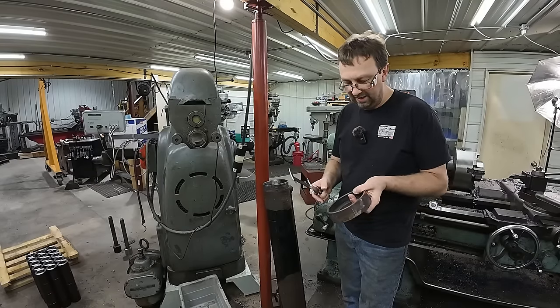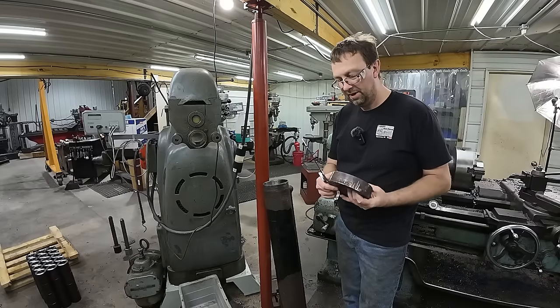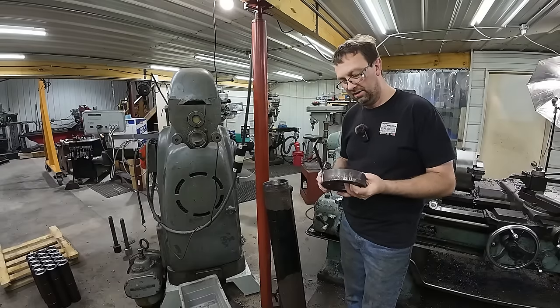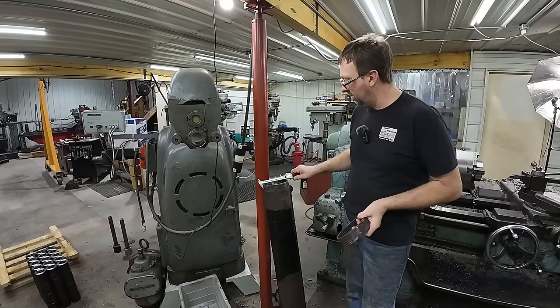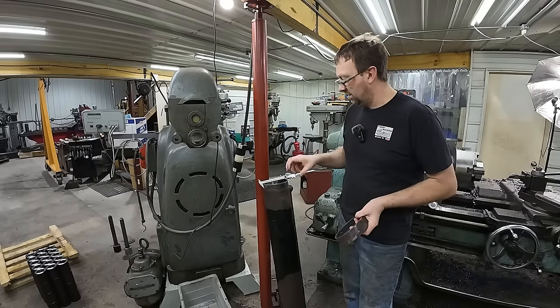So, I can see quite a difference in this thing. When you cut these, they do spring shut, and that's a problem for measuring, but just do the calculations by the book and get your minor diameter and then go from there.